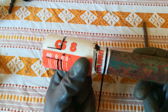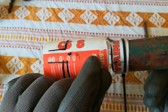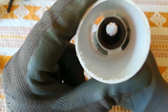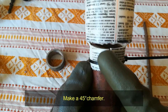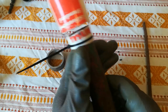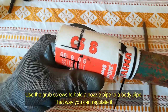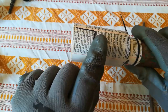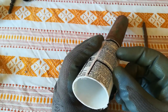This is how our nozzle will look before you weld it — this pipe reduction. As you can see, here are two tabs that are bent like that, and here's the inside. We have two cut-offs, one here and one here. Leave a one millimeter gap, put in a beer shim and you're fine. This ring serves as a guide — like that — it will serve as a guide to make sure this pipe stays straight with the main body.